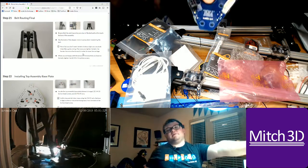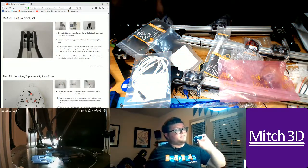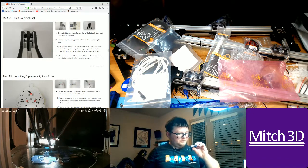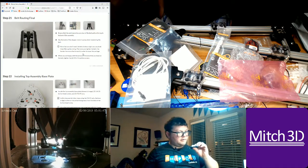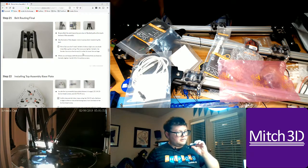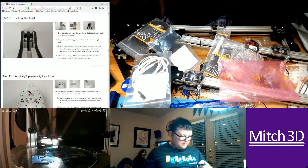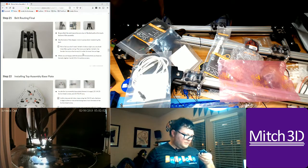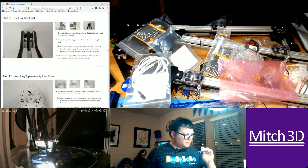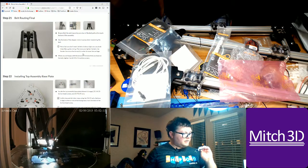It looks like it's a 6-pin connector for the wire coming out of it. Hot end plus and minus, hot end fan plus and minus, part cooling fan plus or minus, and then the secondary output is our Modbus ground. Is that the communication? No, it's not. And then there's three. Why are there so many thermistor inputs? There's additional thermistor inputs. Oh, okay. So reset, clock, ground. I think that's for programming.